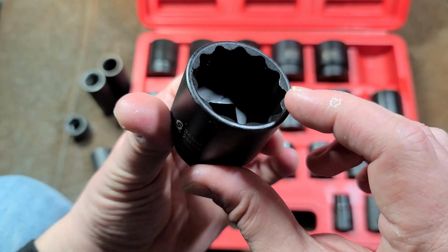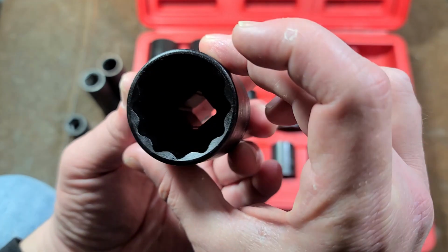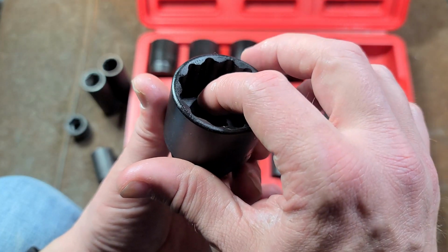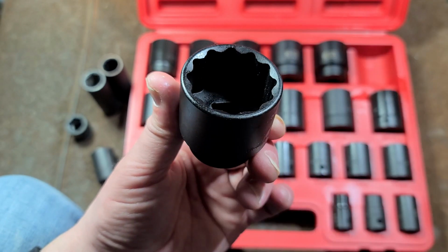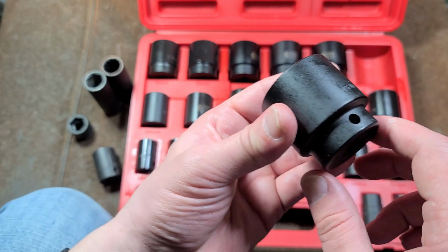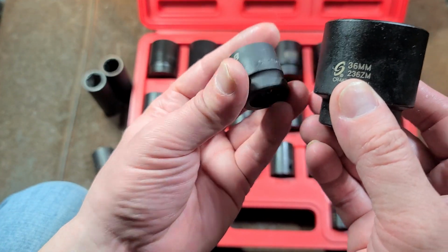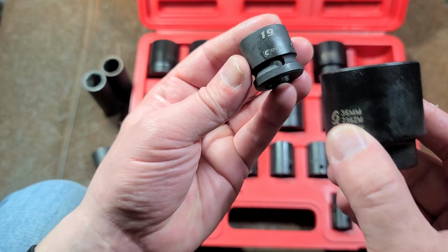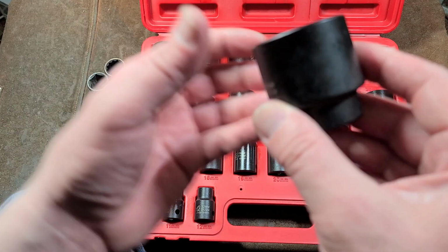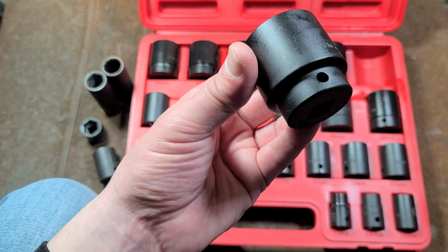Pretty well made. Broaching the bottom of the sockets is really pretty flat. It's kind of hard to see because it's a black socket. It absorbs all the light, but it's really flat. So you get really all the depth. I do like that. I kind of like the traditionalism where they have a manufactured groove and 2 holes. Even though almost nobody uses that style of retention, which is a through-hole retention and pin retention, I still kind of like when sockets include that.